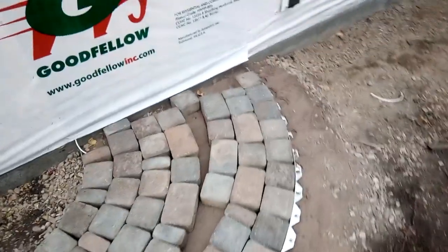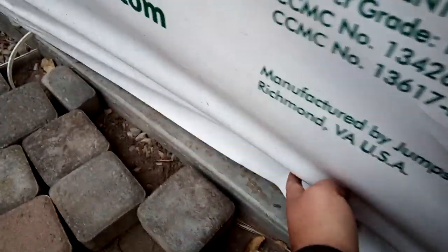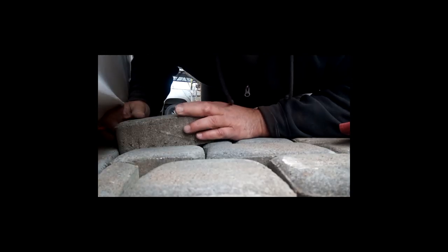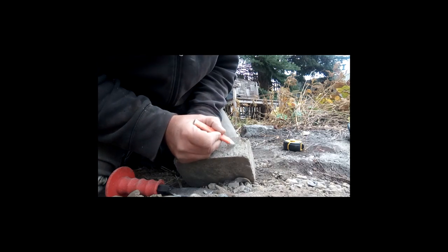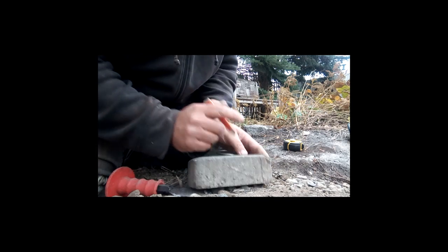When you come to the end you're going to need cuts. It's possible to do this without cutting a brick, but it would really take a lot of planning — and if you're building a perfectly square patio you probably don't need cuts. But the customer wanted it to kind of flare out at the end, so we're going to have to do some pie cuts or wedge cuts, because it was flush with the garage and with a big hunk of sandstone.